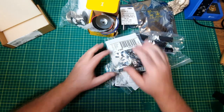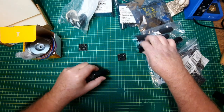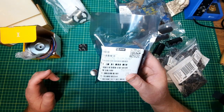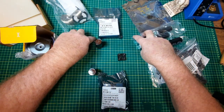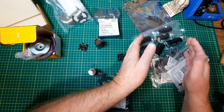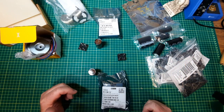Basically, I'm going to make a linear power supply. It's going to have a transformer, bridge rectifier, and capacitors. On the top side will be the positive, on the bottom side will be the negative. There will be two voltage regulators — the first one will be used as a constant current, or current limiting, and then the second one will be used for actually adjusting the voltage. And then further over I'll have some displays. That's about it.